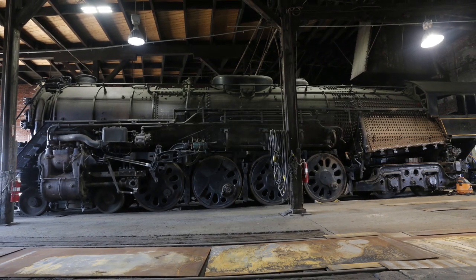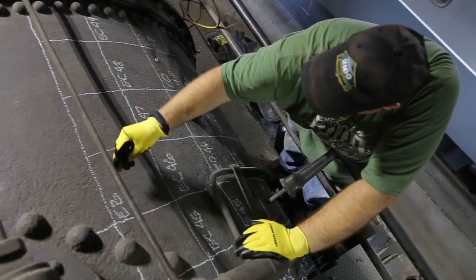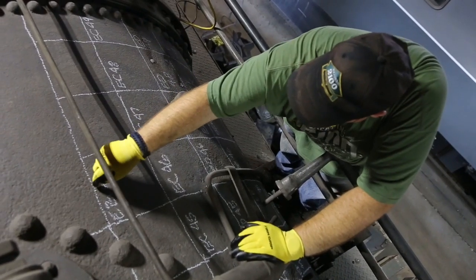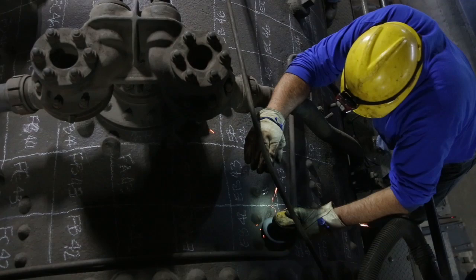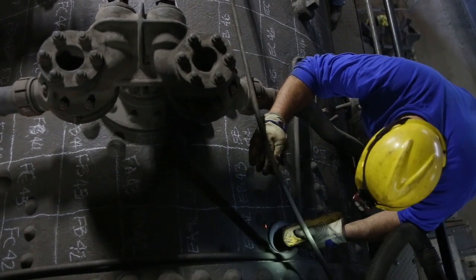The reason we're doing this is that the locomotive's 1472-day inspection is coming due next summer, and a full boiler survey is required for the next inspection. What we have to do is grid off the boiler into 8-inch squares, clean up three spots to take readings, then record those readings to a document so both the FRA and we know the thickness of the boiler.